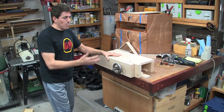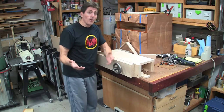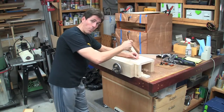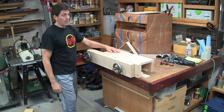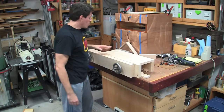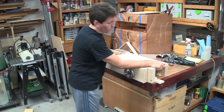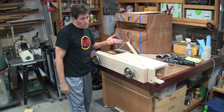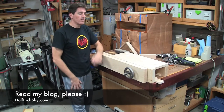I don't tend to leave it out all the time, and I won't talk myself out of setting it up because it's so easy. My table is about two-thirds the length of the chop — I set up a little corner on my bench to figure out how much room I needed for chopping dovetails, and this was just perfect. It could be longer; since it's just a simple glue joint, I could easily add more stock. The shorter size gives me a little room on the bench for parts, reduces the weight a bit, and it's very easy to add on later if needed.